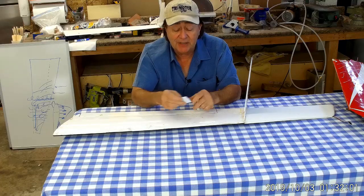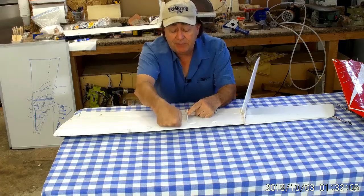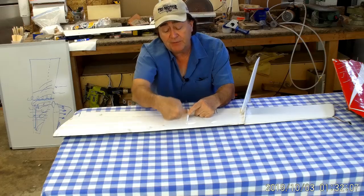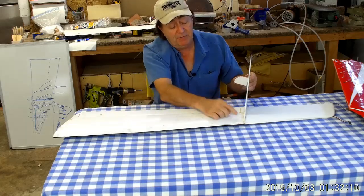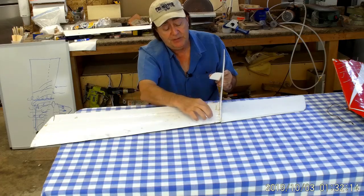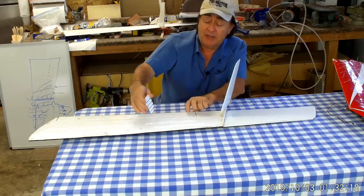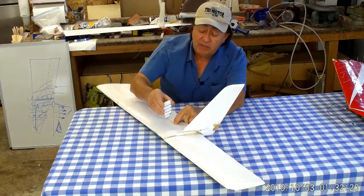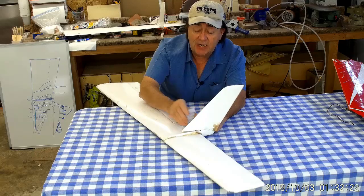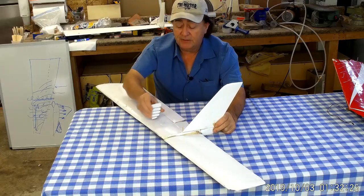And what's happening, if you imagine that this is the actual fence, and I've got flow going on this surface, and I've got flow going on this surface. And that's what we have here, except on a miniature scale. We've got flow going along this surface, flow along here, and flow along here. So there are two boundary layers. There's this boundary layer, turn the wing this way, we have a boundary layer on the wing like this, and it's everywhere around here. And these are going aft, going aft, going aft.